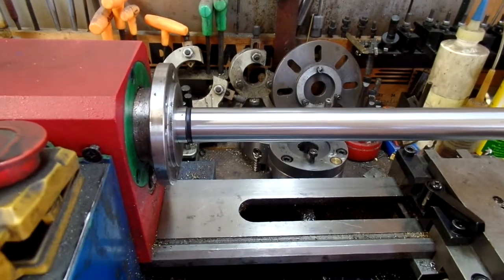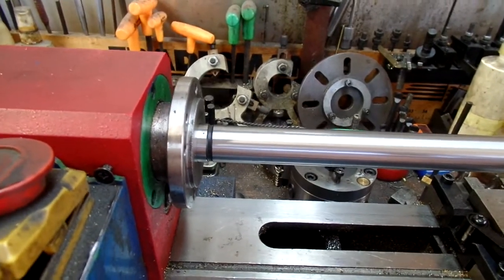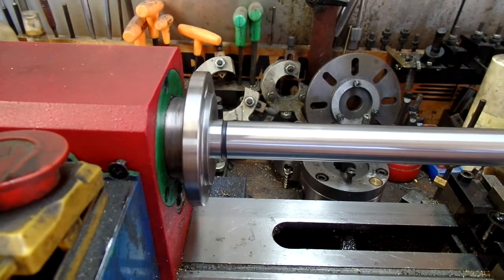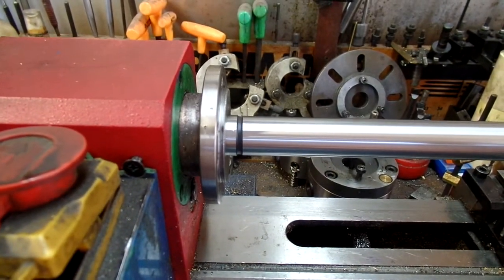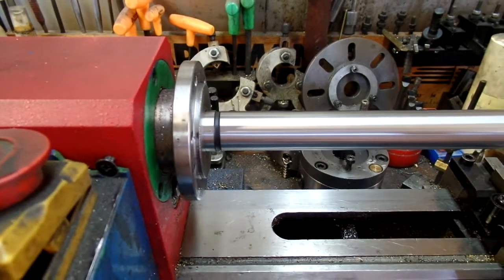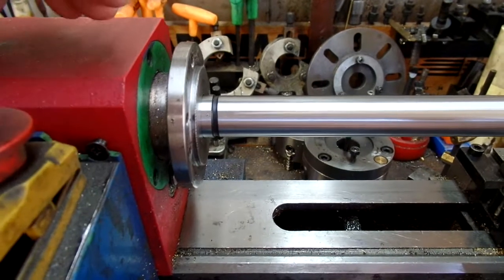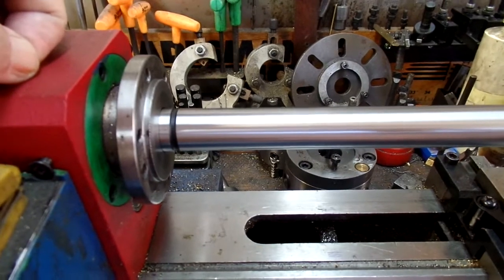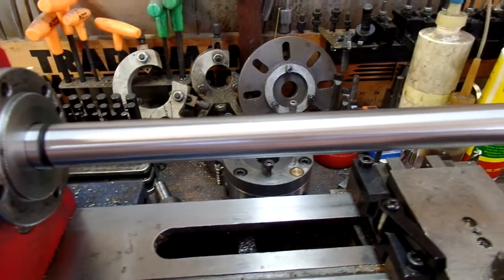It arrived in good condition as far as I could tell. To eliminate potential issues, I indicate while the lathe is running slowly and then by hand to find the high spot and low spot, and you can get an average reading for center. I had to add shims to the headstock to give it a twist to get it in line, because the machining of the headstock was inaccurate.